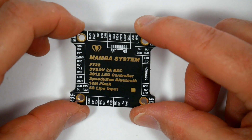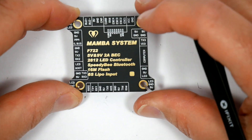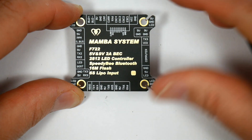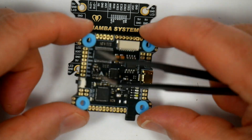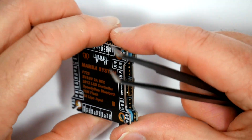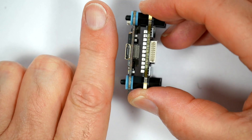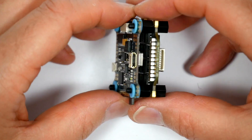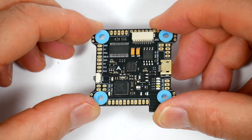It's a neat feature — documenting where all the pads are with a PCB cover plate. Quite a nice idea. And although this is really well labelled, I'll leave a link in the description to the Diatone connection diagram. Diatone also have a big warning on their website about leaving at least 5mm of space between the flight controller board and anything else — they're specifying 5mm because this board just gets hot and needs really good airflow around it. So you've been warned.